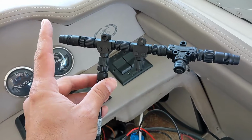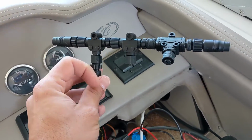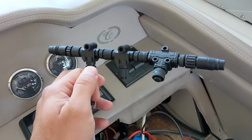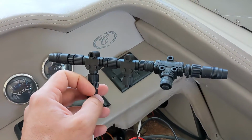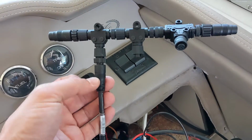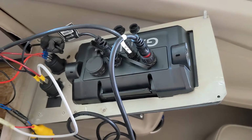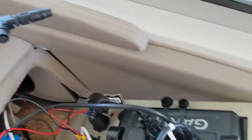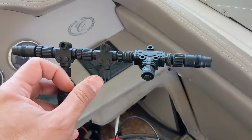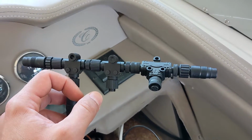They're going to belong on each and opposite end. So you need 2 terminators, one here, one over there, and then enough T connectors or splitters to connect all of your devices and your power. This one I have connected here is going to our Garmin UHD chart plotter, and the middle one I'm going to run to power with the yellow backbone power cable.